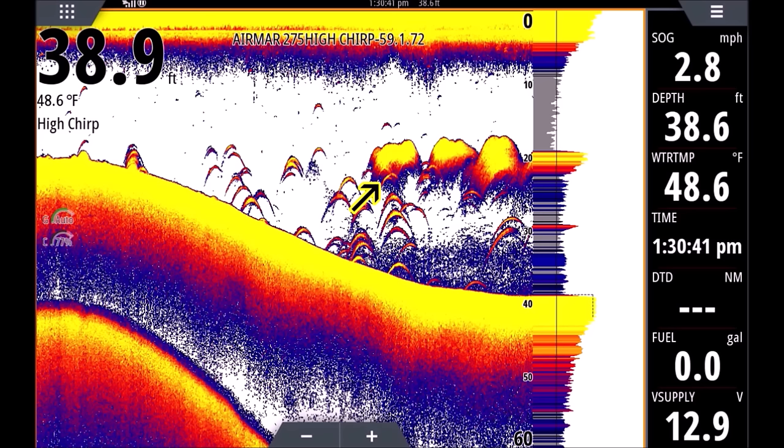That's the best way. Now the fish obviously could have swam away, and I'm sure it did. But for those of you asking, after the fish passes under the boat, where the heck is it? Well, our transducer is looking down. It was under the boat. It was the depth it says when it passes through the A-scope. After we leave it, the fish could swim completely different, in a different spot, different speed, could be gone. We could scare it away, who knows? But for a good guesstimation, just touch it on the screen.